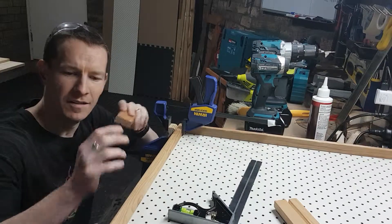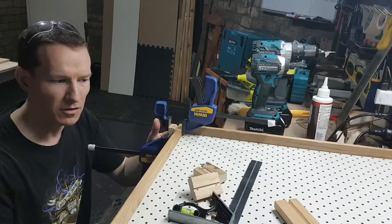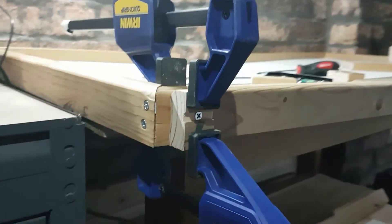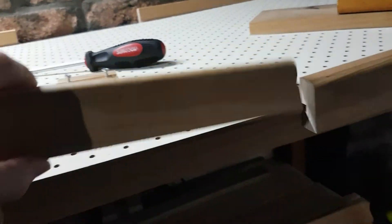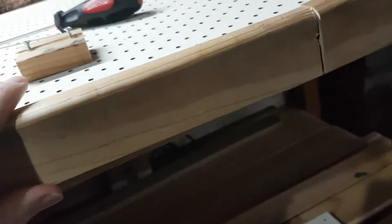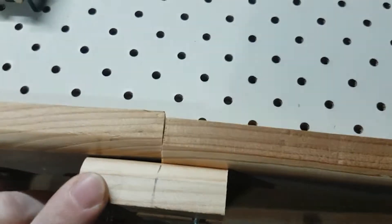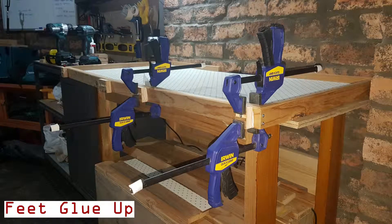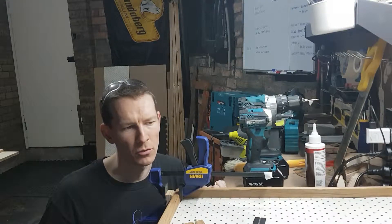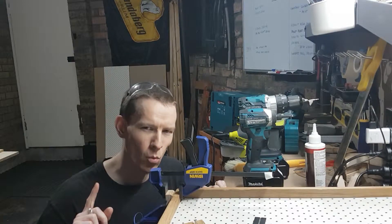One of my little offcuts — a test piece actually — I've cut into two 6cm bits and two 3cm bits. The first one I've already got installed. These are my middle sections and I was trying to figure out a secure way of doing that — as we learned, end-grain glue ain't gonna cut it. Even though this isn't structural, I don't want it popping out. I've done a bit of YouTube research on end-grain gluing and sealing it up will help — the glue just wicks right in, literally like straws. Those mitres were never going to work. I'm going to put my piece in the middle, secure it with a bridge of two of these feet on either side, and replicate the foot over there. That will be the bottom of the pegboard done. Still got to figure out what I'm going to do at the top, but I've got a sneaking suspicion that this pegboard has at least one more feature to go.